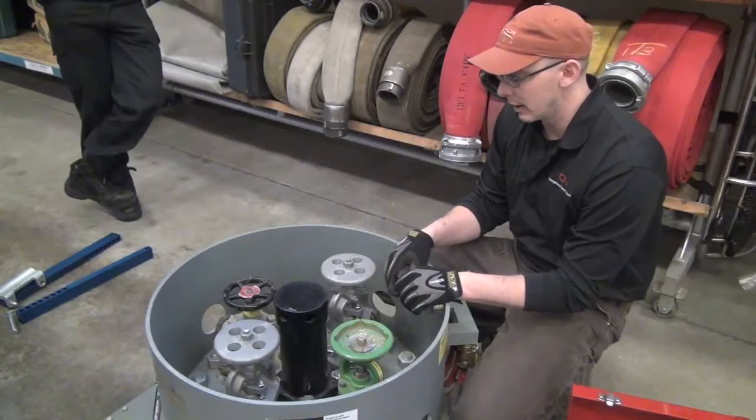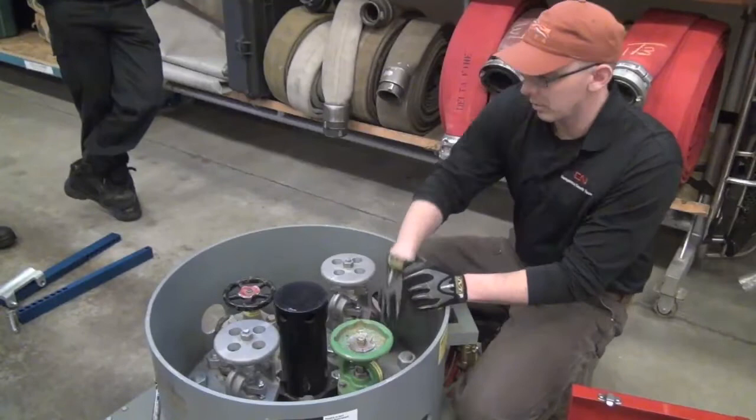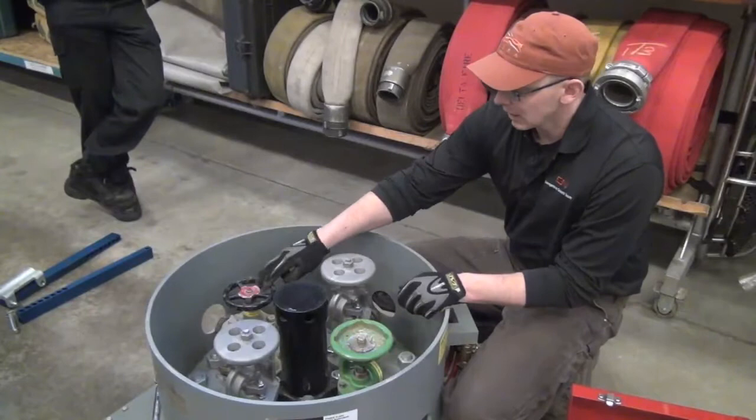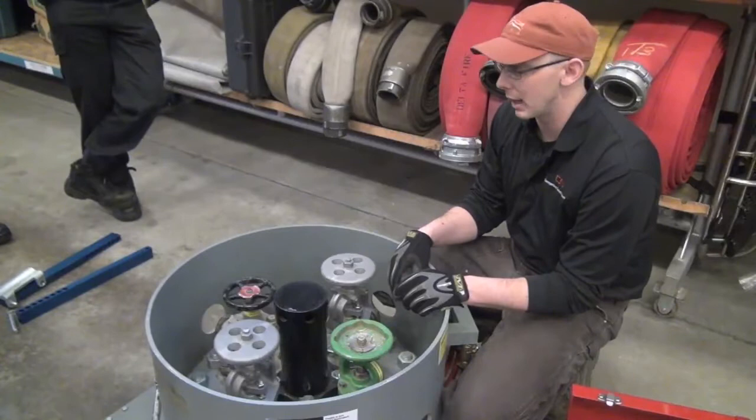Same deal with the safety valve - check there and then down around the bottom to really identify the source. The ammonia works just fine on sulfur dioxide as well - you get the same white puff result. For LPG and anhydrous ammonia, just use soapy water. You're not going to make acid or hurt anything aggressive enough to tear up the car, but it'll help you identify where the leak is.